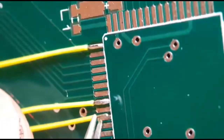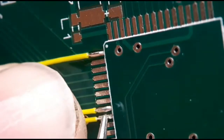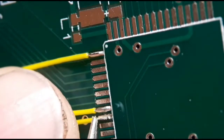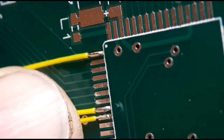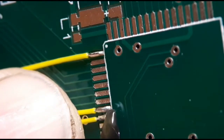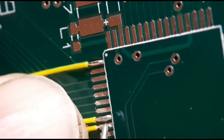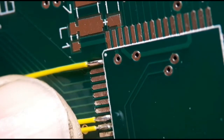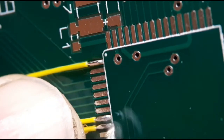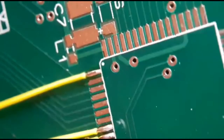The sort of secret is if you keep one wire central you're always fine, but if a wire goes right over to one side you'll struggle. Keep it all in the middle and it should be all right. Tack this wire into place — a little bit of flux, get that inner cord a little bit lower. If you're doing short wires, always prepare them to length beforehand. If you're doing long wires, solder them as you go.